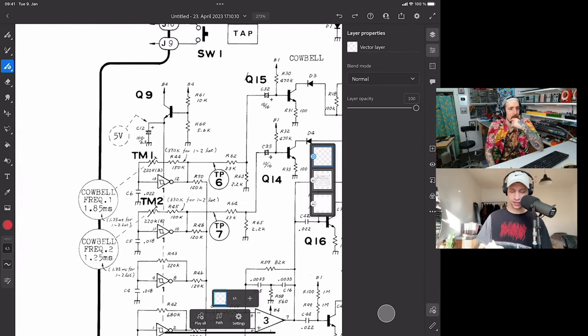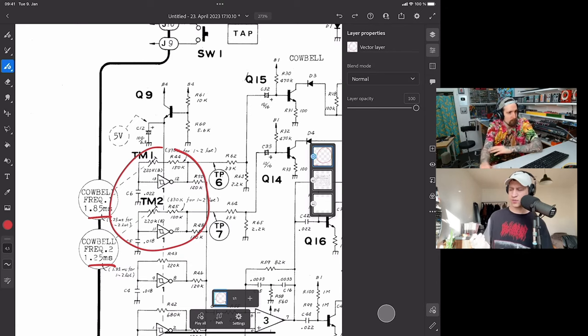First of all, I went back and set up these two oscillators with the proper pitch. I took my time, I set them up, I added the trimmer, I took out my oscilloscope, and I made sure that we get exactly these frequencies for the oscillation. That was quite time consuming, to fine tune them. Then I also noticed that over time the frequency drifted. I'm assuming it has to do with temperature or something. So I spent an embarrassingly long time on that, but got it to work.